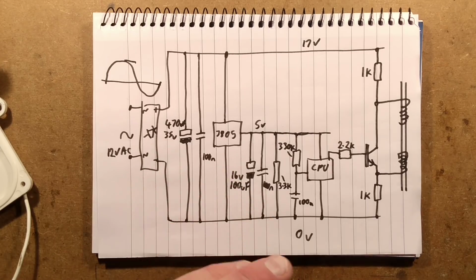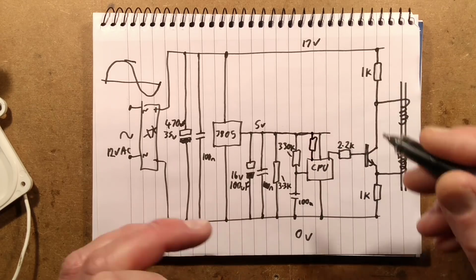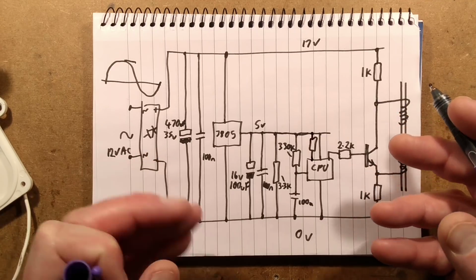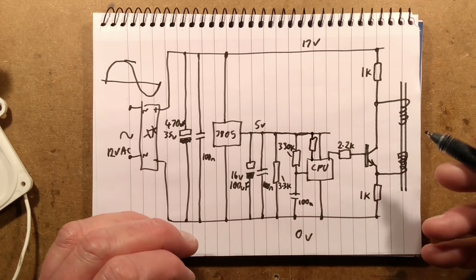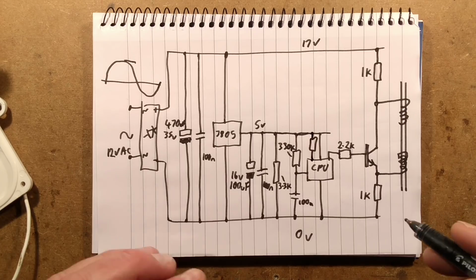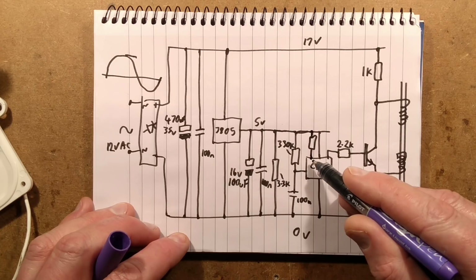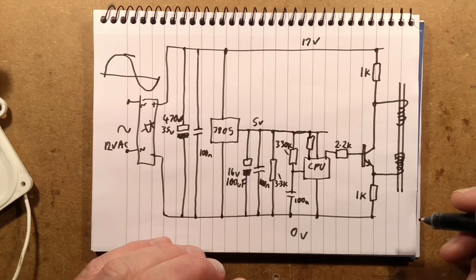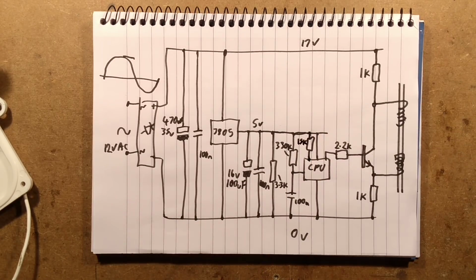They've used a resistor for that, to hold a pin in a known state. I'm not quite sure. Sometimes on microcontrollers the pins can be pulled up high or low internally, but you can't really leave them floating, and it may just be that this one doesn't have that facility, so it has to be tied to a logic level. It kind of doubles as an oscillator pin, which would make sense. They wouldn't want to load it with internal extra circuitry, so it makes sense to have that resistor. It's got a value of 15K. Let's write that in, 15K. That's just to nudge it up.